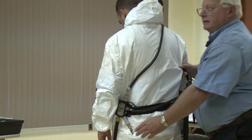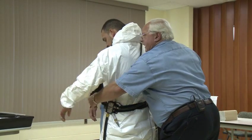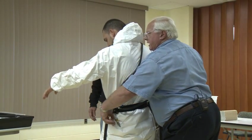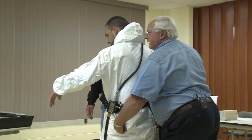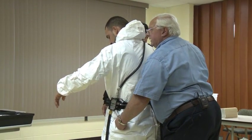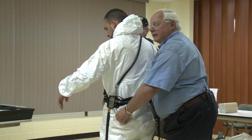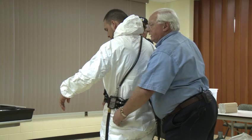If he's got a mask on, do you think he can see this real well? No. But if he does have his air bottle — because that's going to hook onto here — he can actually come back here with his hand, with that bottle, feel it, and then snap it in. Then he's got to give it a tug, make sure it's where it's locked in. So he's hooked in.